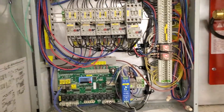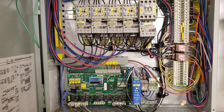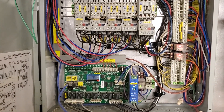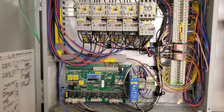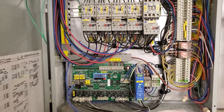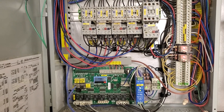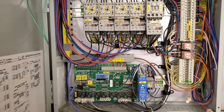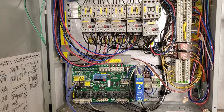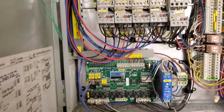If they didn't come back on and hit the fan-on switch, the hoods would turn themselves on via temperature. The temperature of the heat coming off would manually turn the hoods on — that's my assumption, the way these things usually work. So if they didn't turn the power switch back on, the hoods would turn on. But then when they got slow — theoretically, the hoods might shut off and then turn back on when they sense temperature again. It's a possibility because I'm not seeing anything else wrong.